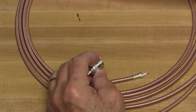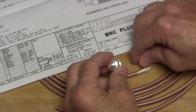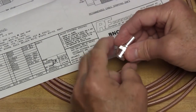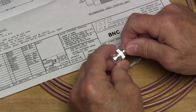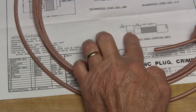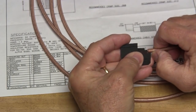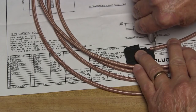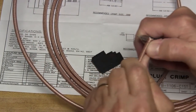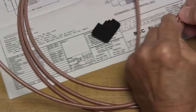Now for BNC connectors, I'm not generally a big fan of crimp-on connectors, but for these I am. I will crimp the center pin as well, but I'm also going to solder it — there's a little hole in the side where you can flow solder into it. If you've ever tried to put a standard BNC connector together with the little nut on the back, this is so much easier and you'll do a much better job. It's easiest to start right at the end and work your way back. I'll use my gauge or calipers to determine how much center conductor I need sticking through, then begin cutting the cable using a sharp knife. I've got to go through two shields without nicking the center conductor.